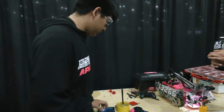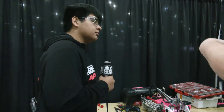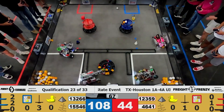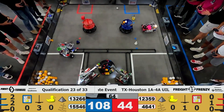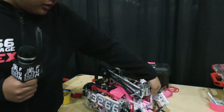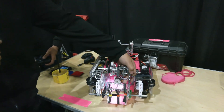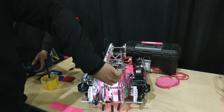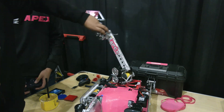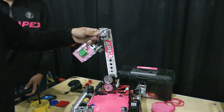We're going to go over to Chris next, who's going to talk about the turret. The arm is a virtual four-bar arm which flips out like this. The process of intaking freight is: first it would intake the freight, then the color sensor would detect the freight, clamp onto it, and then we would move the arm up to whatever position we want. So we can do either right, left, or back, and we can orient this any way we want — this way or this way — to whatever suits our needs.